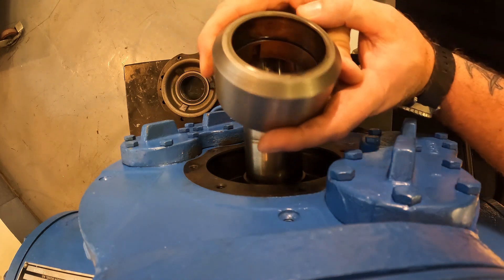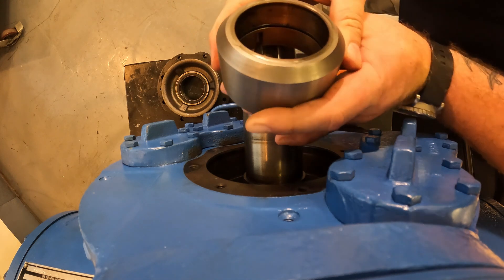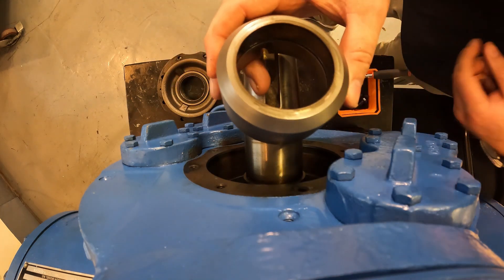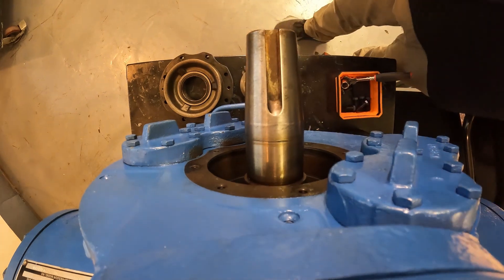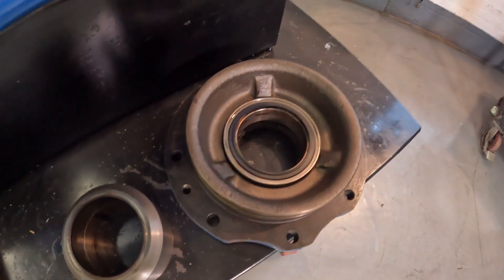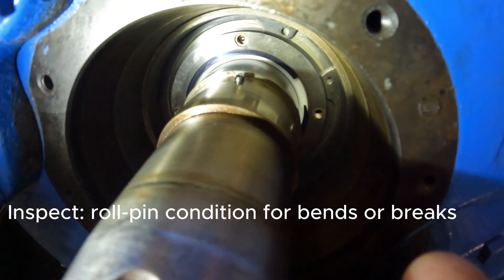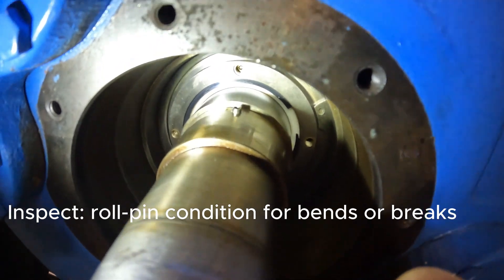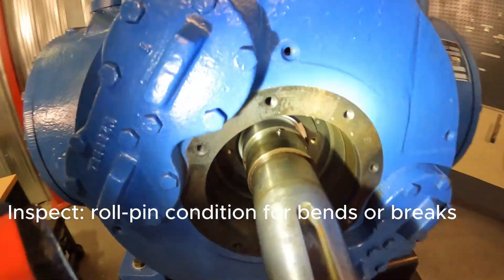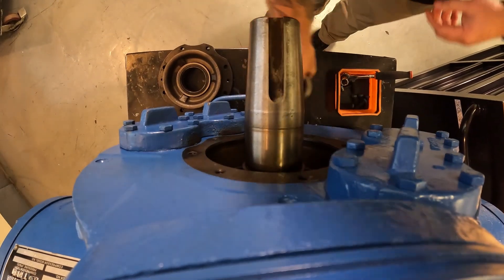This is a training compressor that comes apart all the time, so you have to kind of ignore for this purpose the condition of the seats. When you're changing a seal, you do want to make sure that you keep your fingers off of the faces of the seals. With all the seals disassembled, now's the time to take a good look inside your machine as well. Make sure everything is nice and clean. You're going to look for your anti-rotation pin — make sure it's in place, not damaged or twisted. Make sure there's no scoring, scratching, or damage to the shaft itself, and nothing that can impede the O-ring seal.